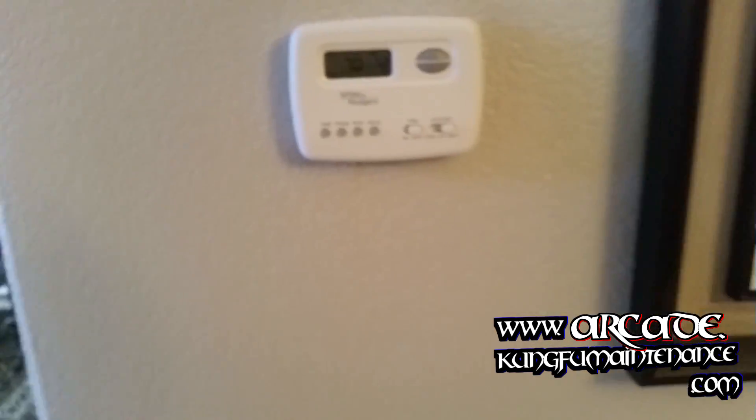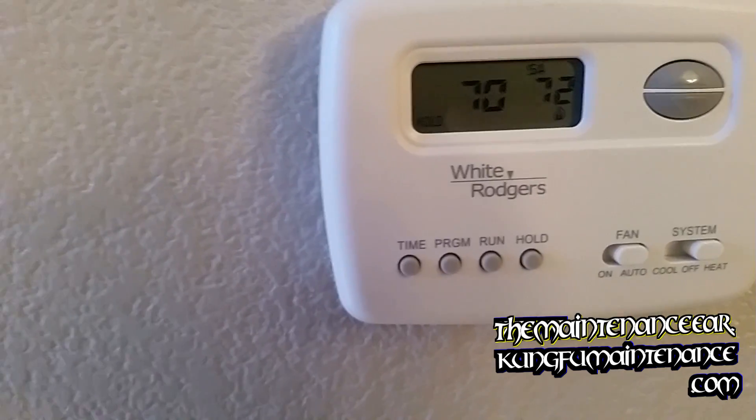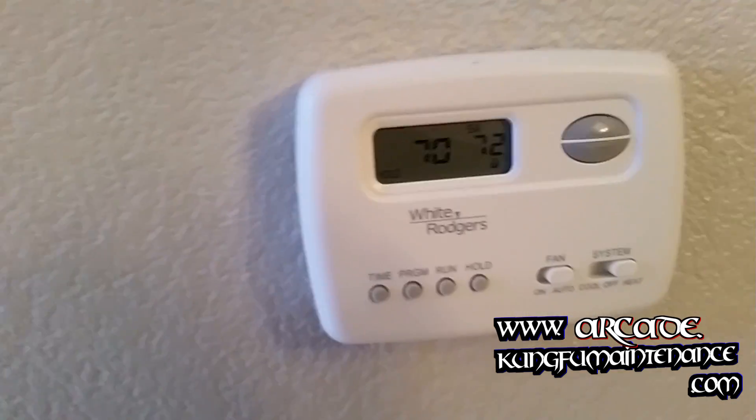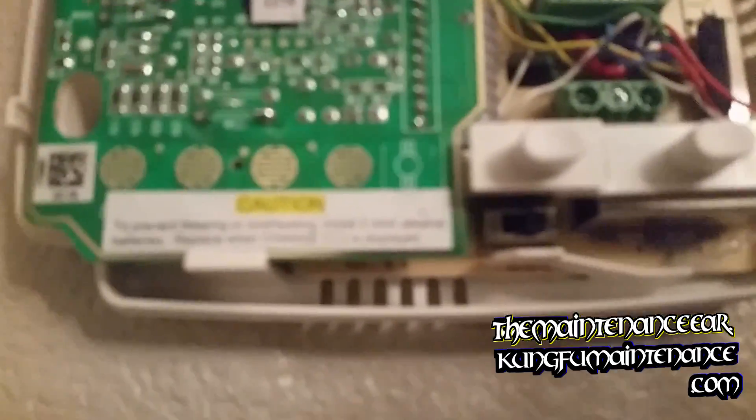It's rare, but these are the things that happen. A little bit on the troubleshooting — obviously if a wire is not making contact, things aren't going to turn on. One other thing I had checked on this, which should be checked when a thermostat is not working, is the jumper pin or the switch setting.